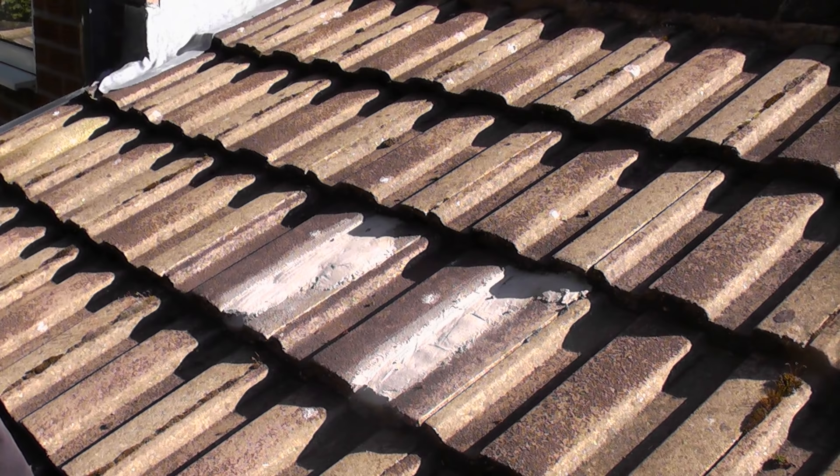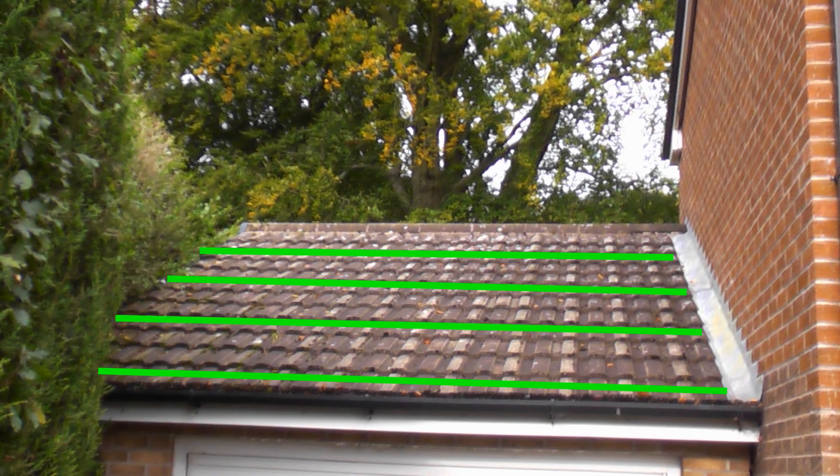It's quite common in the UK to nail every third row of tiles. As in this picture, I have identified where the tiles would be nailed — the first row near the gutter would be nailed, you'd then miss two out, the next one would be nailed, and so on up the roof. It's quite easy to tell if they're nailed: if you give them a push with the hammer handle you will soon find out if you can't actually move the tile.